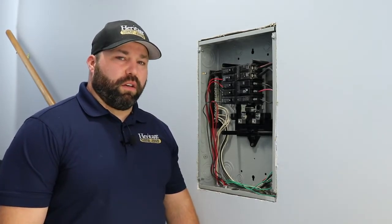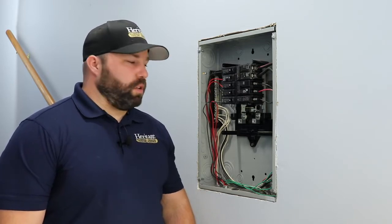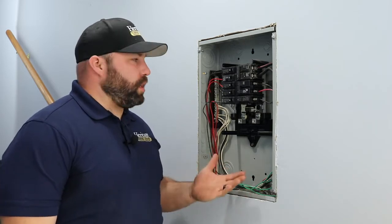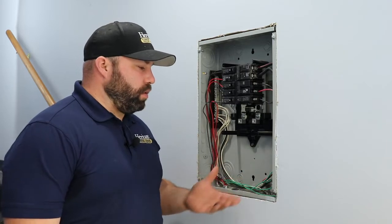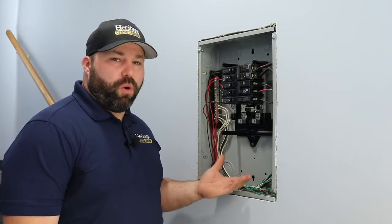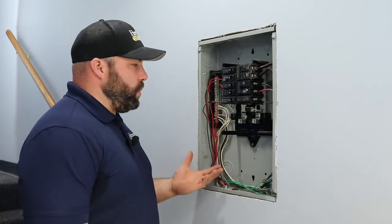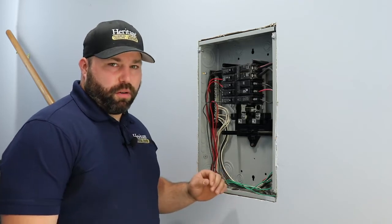One thing we recommend is an electrical safety inspection. When doing the electrical safety inspection, the first thing we check is the electrical panel. When we check the panel, we check to make sure that all the breakers are sized adequately. We also check to make sure that there is no wetness or moisture which could cause rust or corrosion. When we check the electrical panel, we also make sure that there is only one wire underneath each breaker.